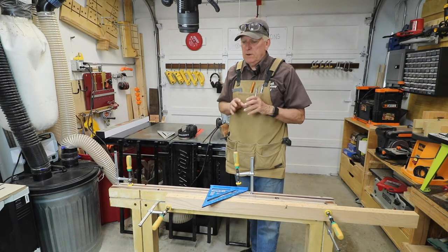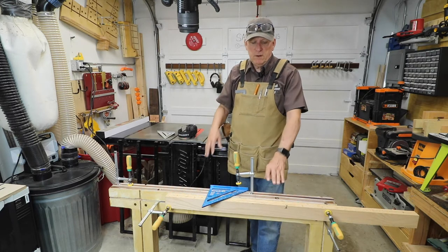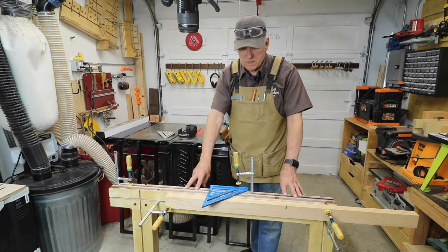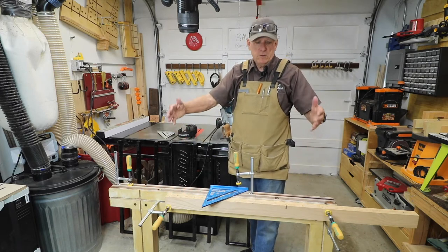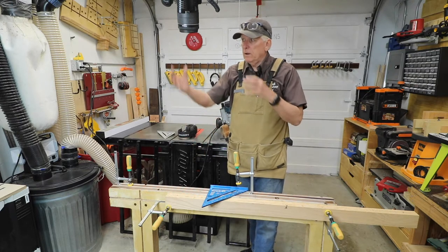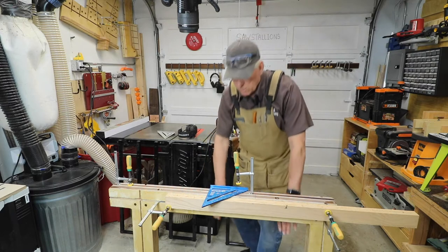I have an alternative — in fact I use it often when I don't want to stop and build a template, because that takes time. With this setup I'm going to show you, I can use these saw horses, which I call Saw Stallions. That's a set of saw horses that have matchfit dovetail grooves in the top, in the sides of the top, and in all of the faces of the legs and the bottom trestle. The beauty of that is I can use these matchfit dovetail clamps for a lot of flexible clamping capability, as well as use my regular DeWalt clamps, because when you're using saw horses or Saw Stallions you've got a lot of places to clamp things — you've got all this room underneath.